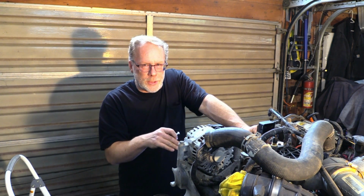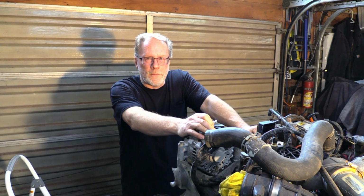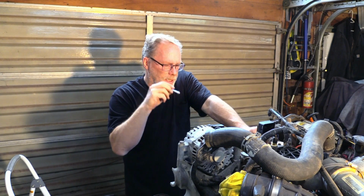Now, in this particular application, depending on who you purchased from and what company of water pump you're going to install, and down in the description is going to be the type of water pump that I always use, which I have fantastic life service out of. They do a really great job, and that's Gates. But always replace your bolts. Do not use the old bolts. These bolts have a certain stretch to them, and part of these are responsible for holding and sealing the timing cover.